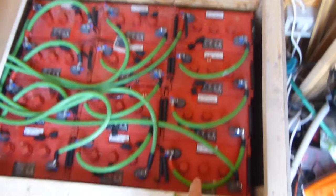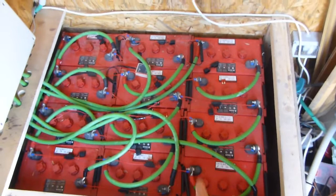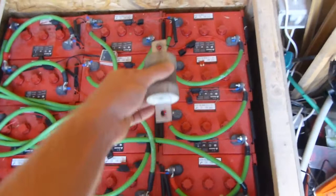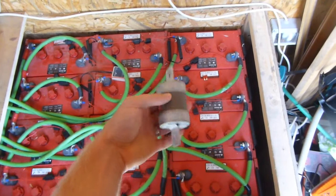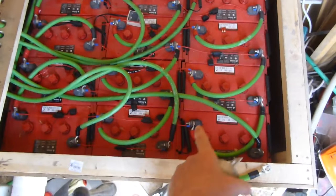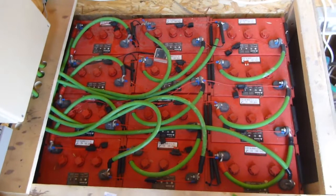I have four cells — that makes it 24 volts, six volts each. So I have essentially three individual banks running in parallel to create one big battery bank, and I'm going to put a midpoint fuse on each bank. The three banks are paralleled to my bus bars, and I have very small cables paralleling each parallel connection with automotive fuses.